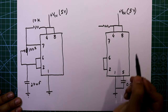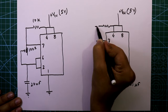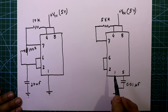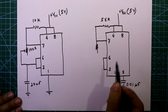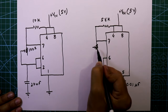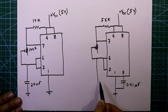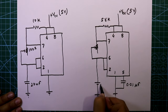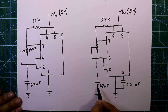Now come to the second IC. One resistor is connected between pin number 7 and plus VCC — the value is 5.6 kilo ohms. One potentiometer is connected between pin 7 and pins 6 and 2: one end to pin 7, the middle pin to pin 6. Then one capacitor is connected to ground — the value is 47 micro Farad, positive side toward pin 6, negative to ground.